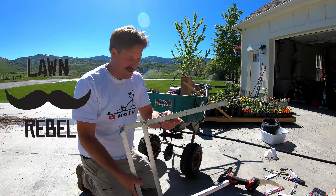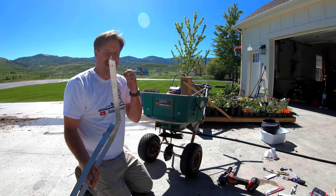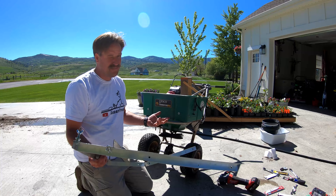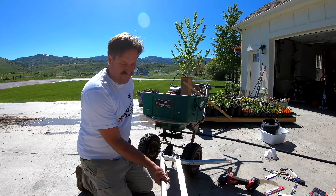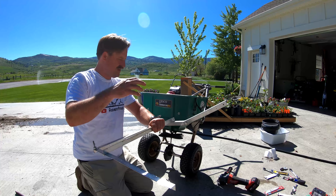I'm going to fix this once and for all. This is part of my sprayer boom and this angle aluminum keeps bending — it's not strong. I wanted it because it's light, but I've frankly had enough. I've got some angle steel and I'm just going to cut two new side pieces.